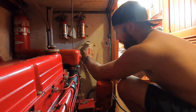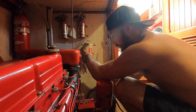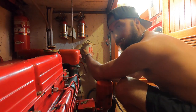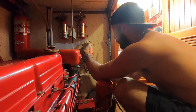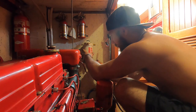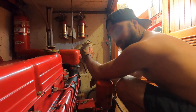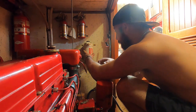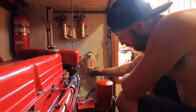I'm going to put this here. I'm actually going to hook a hose to the water dump too and have a spot for one-gallon jugs that I can dump water into, because it's going to be brackish mixed diesel water — you can't just dump it in the bilge. I'm going to run a hose; they have barbed fittings on the bottom. So if I need to dump water, say in the morning before we fire the engine, I can just dump into a gallon jug and once it's full, dispose of it properly. I've got it mounted kind of high so I've got room to use it.